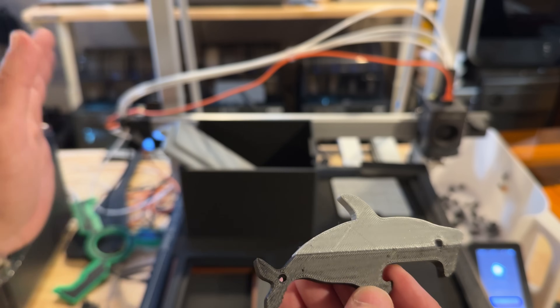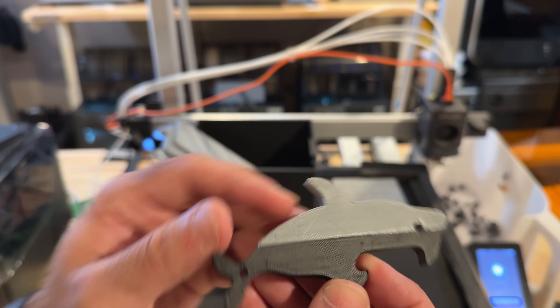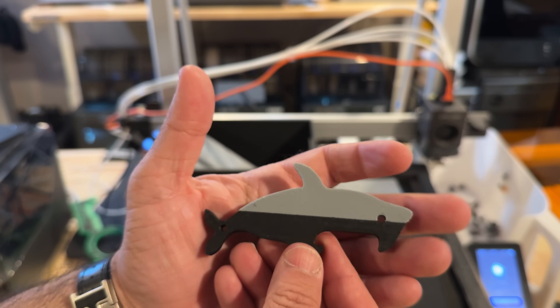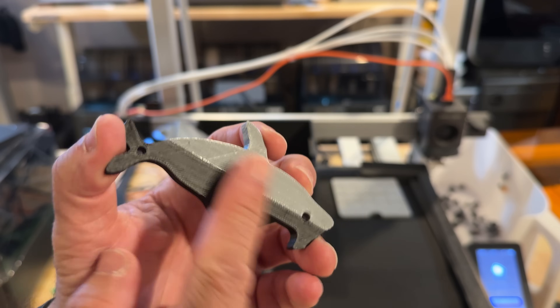We print many things — a lot of functional parts and accessories. I wanted to see how multi-color prints would work out, and we printed a bottle opener from the included USB memory using two colors. We primarily print in gray, black, and white. It did pretty good — I can do some tuning on the filament. The first layer was solid, but the top layer still has areas to improve. I wouldn't give this to a client; the top layer quality is really important to us.